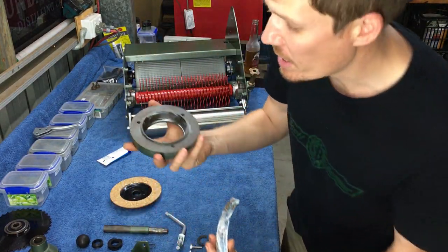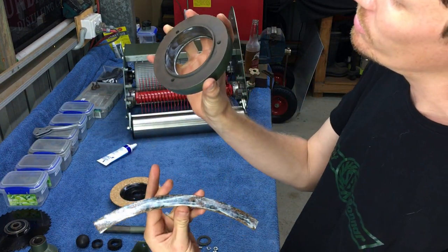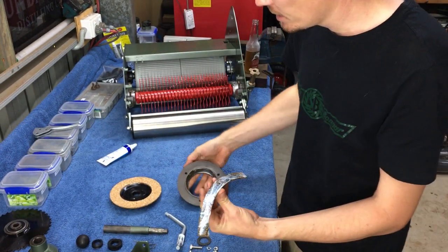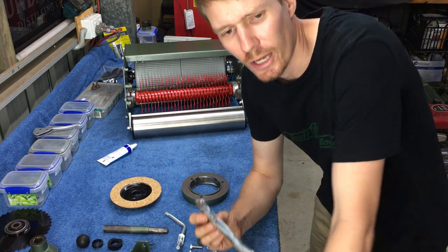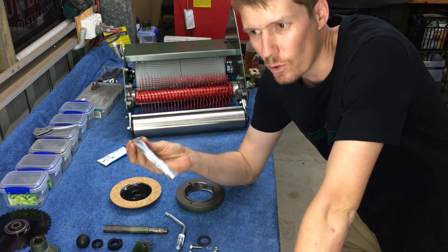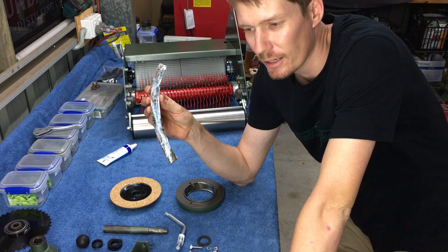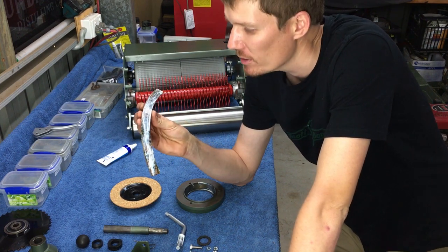So same goes for our drive clutch. Inside here you see all the metal's gone back to metal, I suppose. It's gone clear, so the glue's gone clear. So it's quite tacky. This always happens every time I do it. The metal part dries considerably quicker than the cork. So you can see there's still a fair amount of cream colour on the cork. Not to worry, as long as one of the surfaces has gone that tacky, it sort of sticks together quite well.